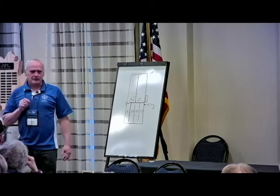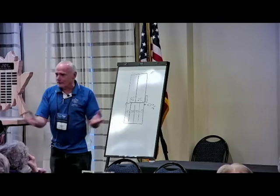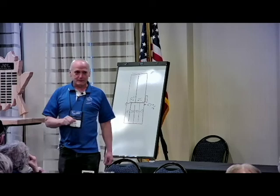And, you know, I worked with Bob Crooks, marketing guy, and I told him, let's do thermometer probes that could go in the various compartments. And we actually do that at our evaporators. I have a thermometer probe in every compartment. So you can see a problem like this coming along.